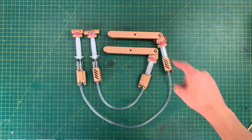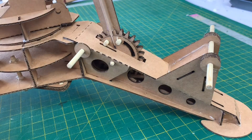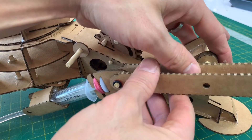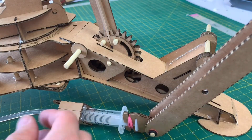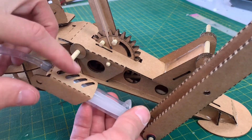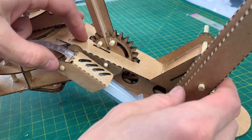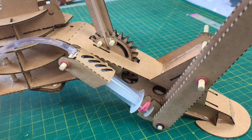That's the two completed circuits including the two levers. Now it's time to install them onto the main body. The short system goes onto the left-hand side — here's your lever and it's going to go this way around. Slide that over, put it on part way to begin with, then lift up this end and rotate it round until the lever is uppermost. Slide both parts home and put on your fiber washers and O-rings.